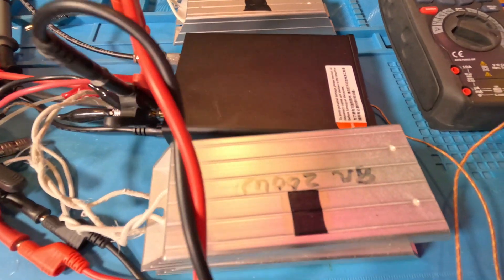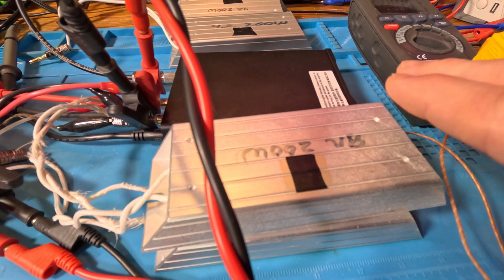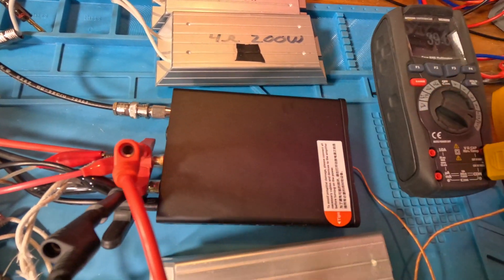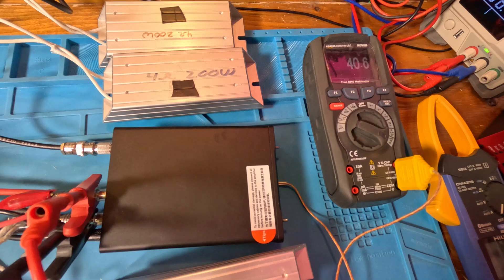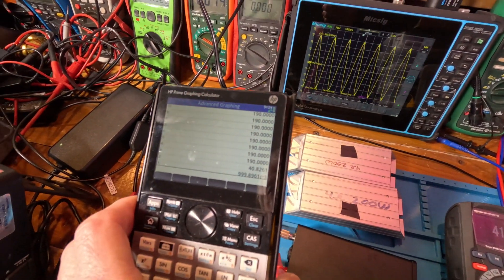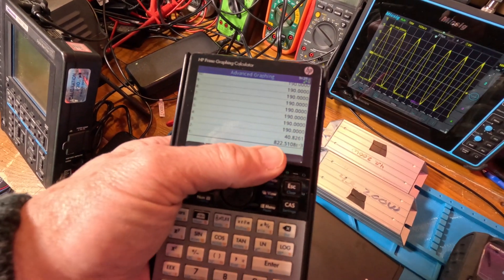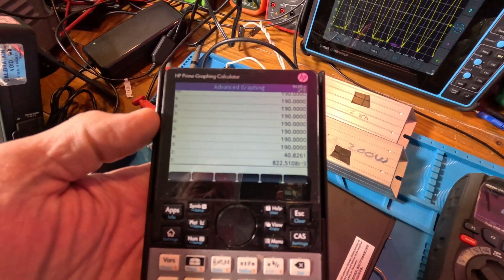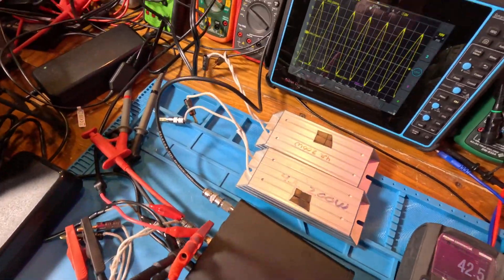They got hot really fast. They're big old resistors and they are rated for 200 watts, but each one is putting in about half the power it's rated for, which means it's going to get really hot. Right now we're only about 40°C — I've got the thermal probe kind of stuck underneath it. That's our signal. We're dissipating about 40.8 watts between this and that, and the overall efficiency is about 82.3%. So yeah, that's pretty darn good.